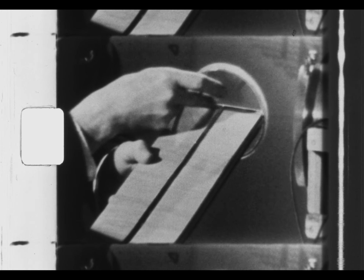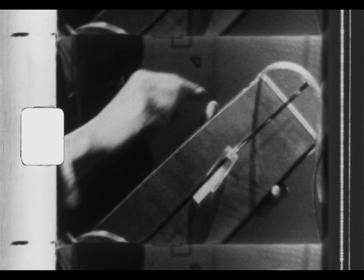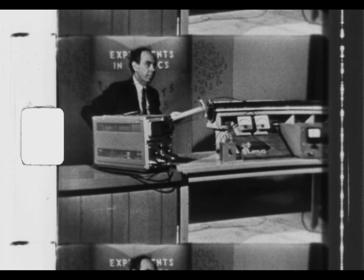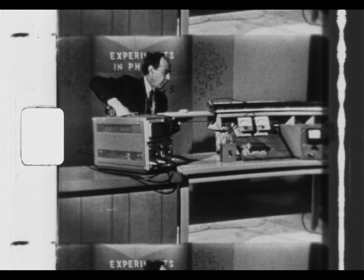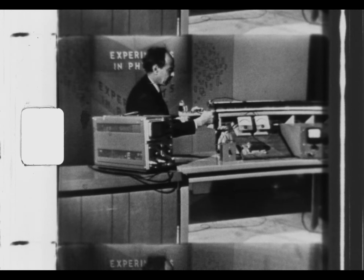On the back side of this, there are also two coils: a half circle which goes like this with the leads coming out together, and on the other side of the board, at the bottom of it, a semicircle which starts on a lead over here, comes around and comes out on another lead here. These wide leads are on the median plane. When this is set in here, that median plane has been adjusted so it really is the median plane of the solenoid.